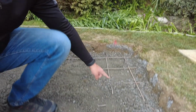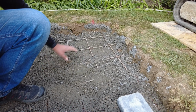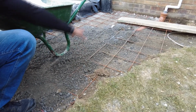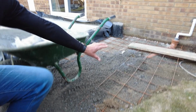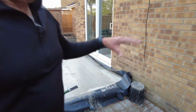You'll see also here they reinforced the crushed concrete with steel mesh, and that is all the way around the paths to protect. You can see it more clearly just here where the steel mesh will be covered over by basically crushed concrete. And they also put down permeable concrete on top, so when the resin goes on, the water just runs straight through.